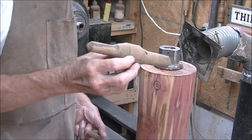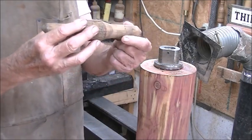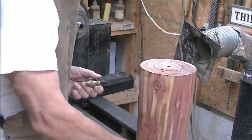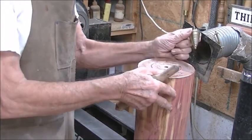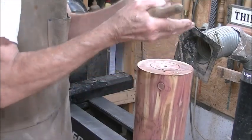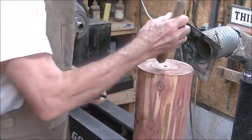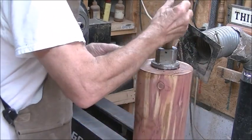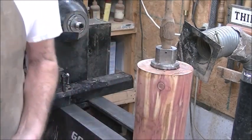It's a double-headed alignment tool. On this end is for 1 1/8 inch, and on this end's for 1 inch. So what you do, or what I do anyway, is it's called a step drill. I come in here, make me a hole right in my center that sort of comes out like that, so it matches this right here. And you can see right there, pretty easy to do, really. And there you are. Can't get much closer than that.